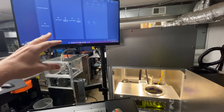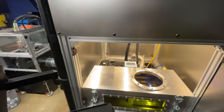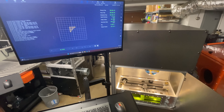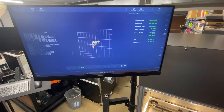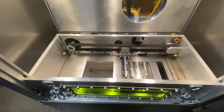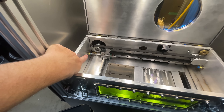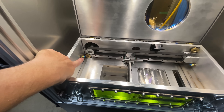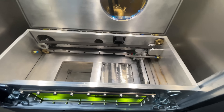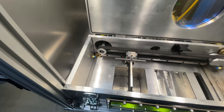Now I need to figure out how to set up the automated functions in the software so it can keep an eye on the oxygen content and open and shut that valve as needed while we're printing. I've been playing around with the printer configurations — I have a file loaded and it's mid-print right now. I'm pretty happy with how everything's working except one thing: these end stops are supposed to have a 2mm detection range, but it appears it's not actually working until it physically hits the sensor, which isn't going to work because I'd like the back movement to go faster to speed up the print.